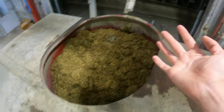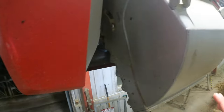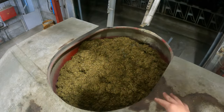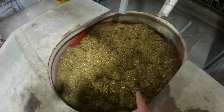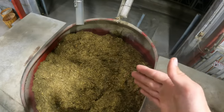The computer system gets just the right amount of feed because in the bottom of the MFR there is a scale that weighs how much feed is in the wagon. So if the grabber has a bit of corn silage over here, it'll take a grab of corn silage, drive over, dump it in, and then the MFR will weigh how much feed was just dumped in and tell it to go get a different type of feed. It doesn't put all the feed in at once.